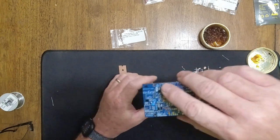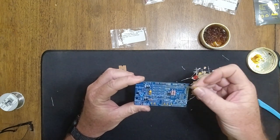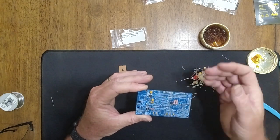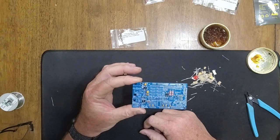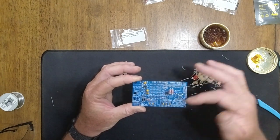Now that we have all the diodes installed and most of the capacitors installed, note that some capacitors are polarized — for example C7. While it may not be quite as clear as with the diodes, similarly C4 is found up in the corner and has a plus sign on the square pad. With these capacitors, the longer leg is the positive side — make sure you put the positive longer leg in. In this kit, only these two larger capacitors are polarized; all the rest of the capacitors can go either direction.